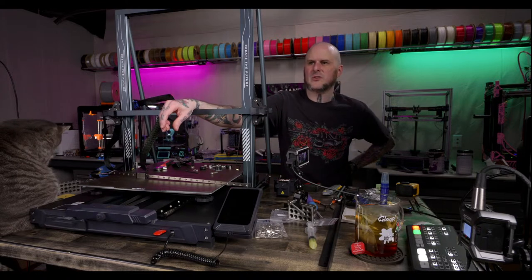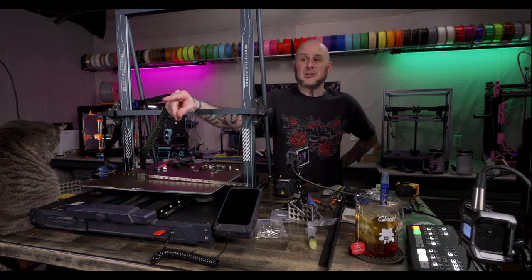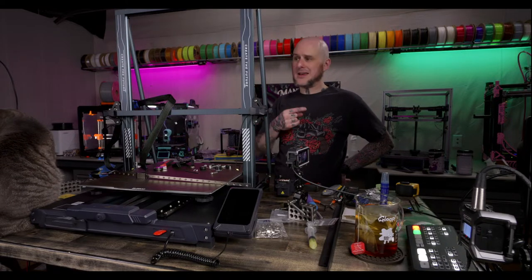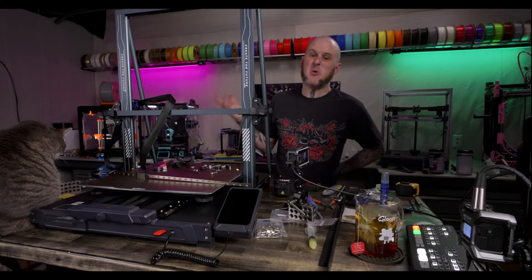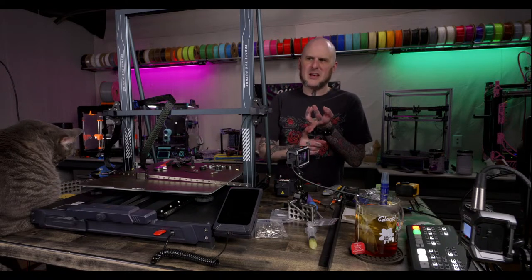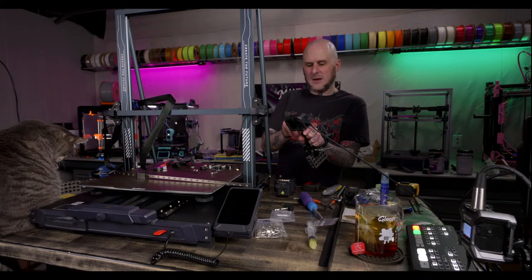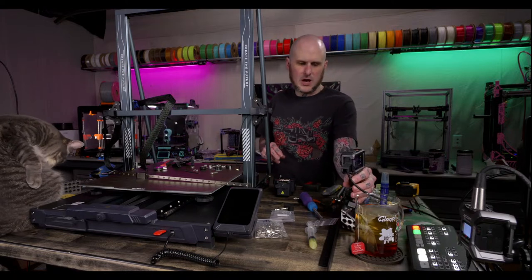So say I put the 600 watt heater in and the 200 watt of the main PSU and 25 of the RPi, the thing then draws a max of 825. Most power supplies can overrun their rating a little bit, so they can draw a little more than they can output. So there's a solid potential you could get up to 1,000 watts if everything is fully loaded. It's unlikely everything will be fully loaded at pretty much any point. Not that hard, because it's not likely your bed's going to be at 100% heating, your hot end's going to be 100%. Just have limited power in my basement. Totally understandable. And also, you can actually, in Klipper, limit the maximum power of the bed, too, so it won't overrun. You can do that.